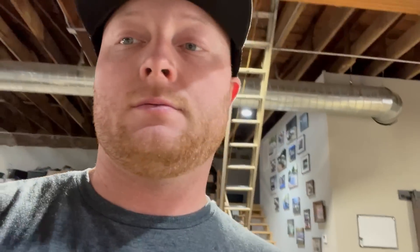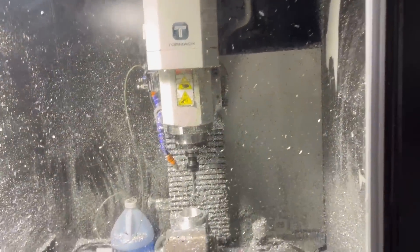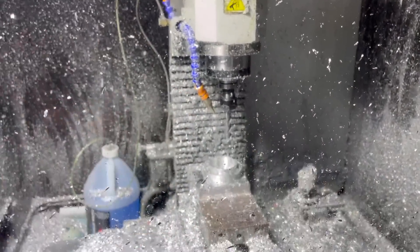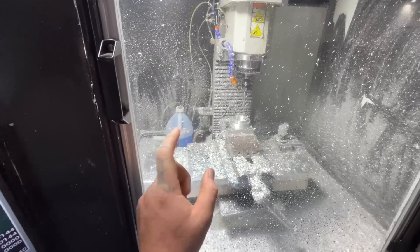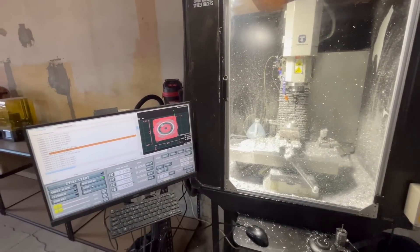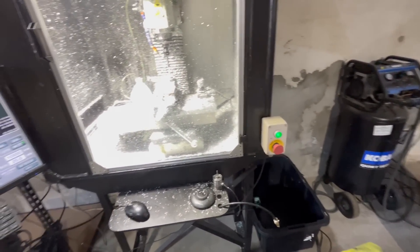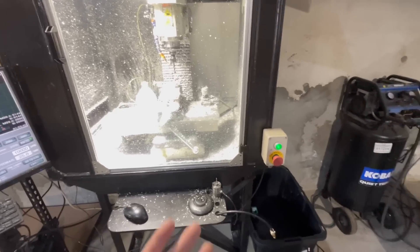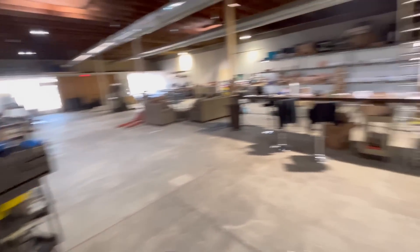I don't know exactly what we're going to use for cooling yet. We were using a mixture of cut stuff and windshield wiper fluid but our spray patterns were very erratic — it would spray sometimes and then get clogged and not spray other times. We took the cutting fluid out and just used windshield wiper fluid and it definitely didn't like that. It ended up dead-stopping the bit because it just wasn't lubricating enough. So we're going to try another mixture, and I may just end up using water or whatever actual flood coolant people use for CNCs.